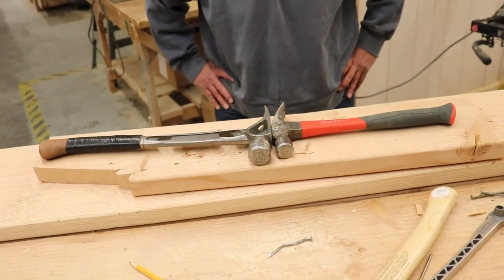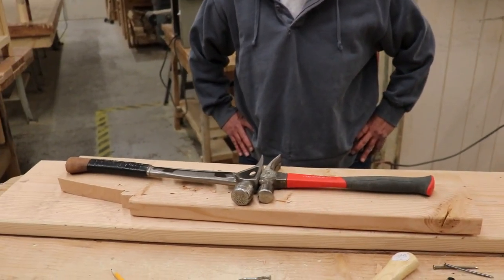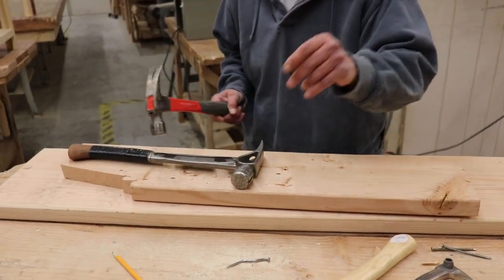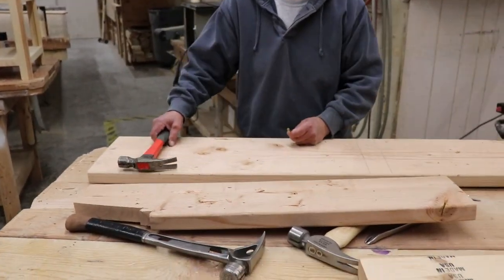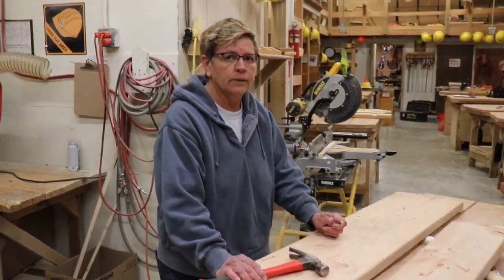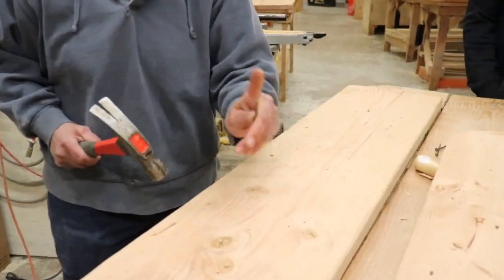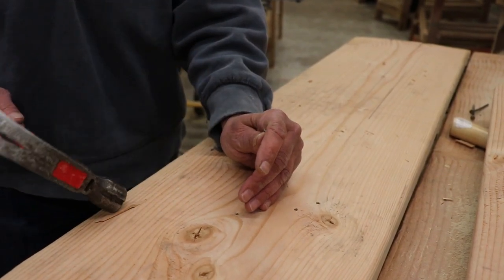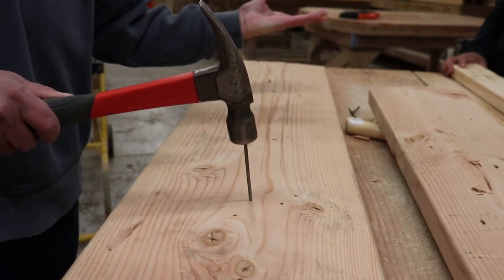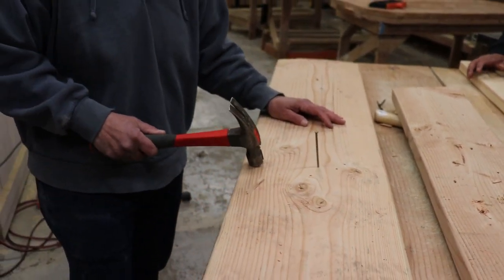The key is that these basic processes — hammering a nail and pulling a nail — need to become second nature. If you've got a hammer available at home, use it, but with extreme caution. Practice and get familiar with pounding nails; it's not as easy as it looks. Kids come in saying they know how to hammer nails and then when we get them in the field putting walls together it's way more challenging than they thought. Also remember: what's holding that nail is your fingers. One strike from this hammer is going to hurt. When setting a nail, keep your hand low, and once the nail is set in the wood, get that hand out of the way — chances are you might miss and hit a knuckle.